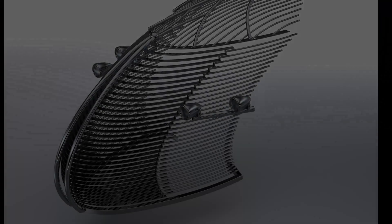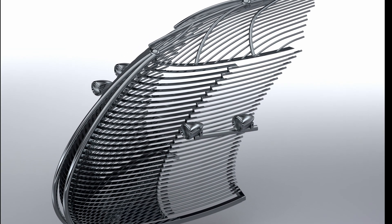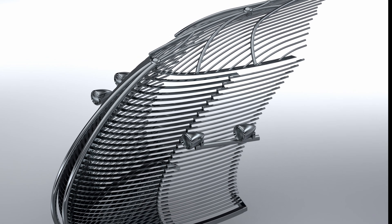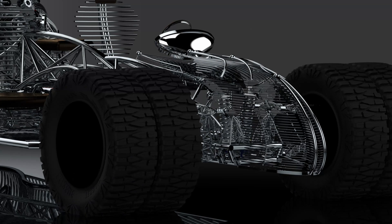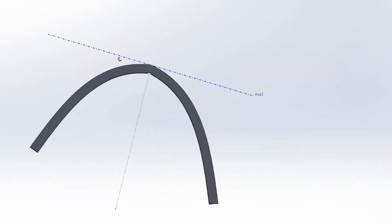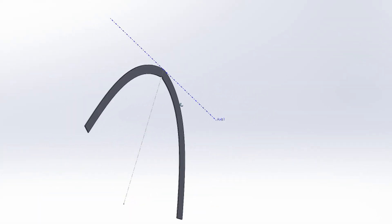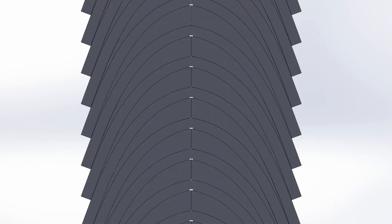The waterjet parts included both the positives and negatives of the cutout shape. The bulk of the definition in this shape consists of 34 identical horizontal flat louvers. They're arrayed vertically into a semi-complex curve I designed utilizing a spline curve in SolidWorks, then attached to the rest of the frame. Here's a CAD model of one of the flat louvers — it's six one-hundredths of an inch thick, 16-gauge stainless steel. This group of louvers is laid out for waterjet cutting. You could use a waterjet, laser, or plasma — it doesn't matter, just as long as you get a nice cut.